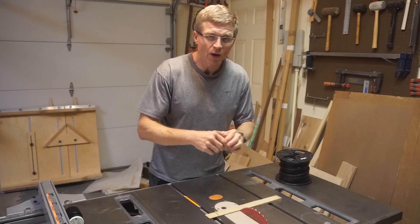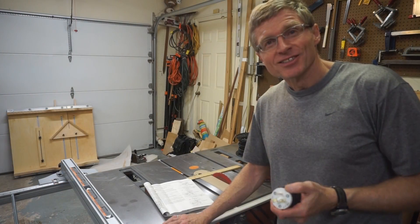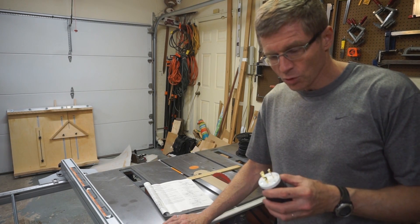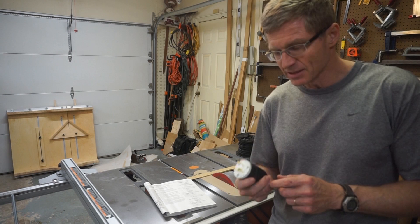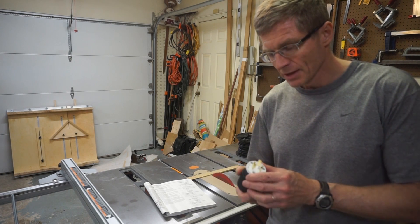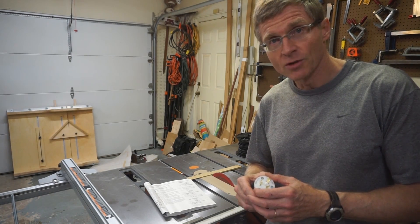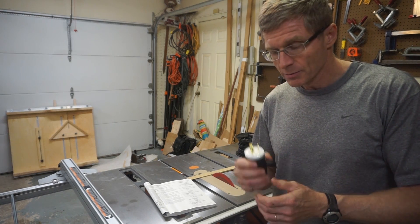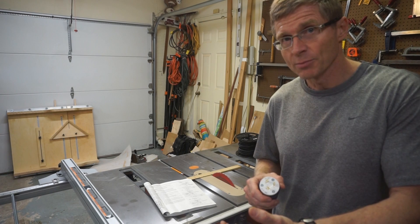Let's go around the back, open up the little wiring compartment on the motor, and get out the manual and follow the instructions. Before you get started, you'll have to make sure that you have all the right tools and pieces. The most important thing to consider is the 240-volt plug. There are different types, designed for different amperages. The one I have is a 20-amp twist-on plug. They also have straight plugs you just push in, and 30-amp plugs — they're not interchangeable.